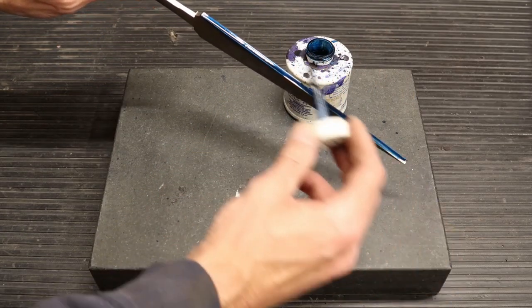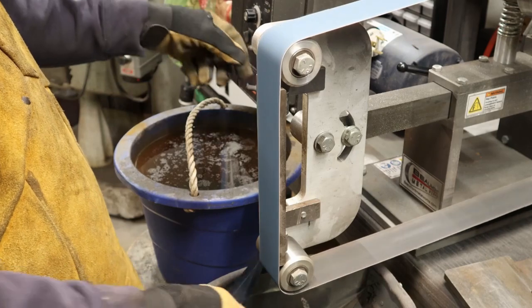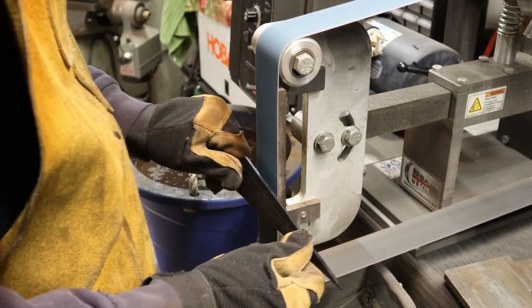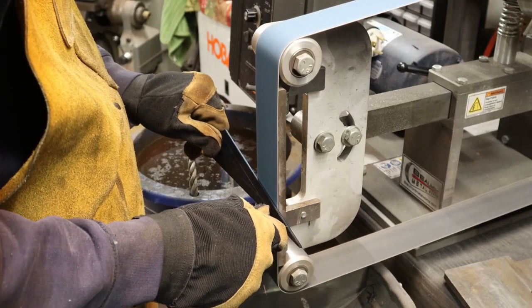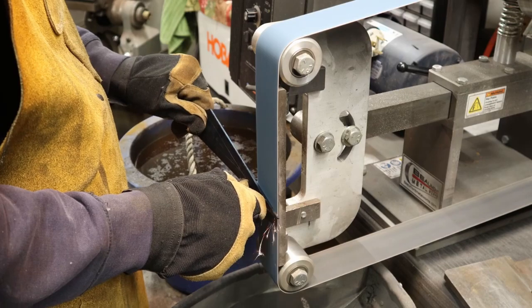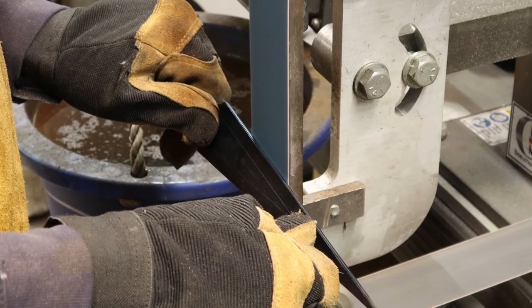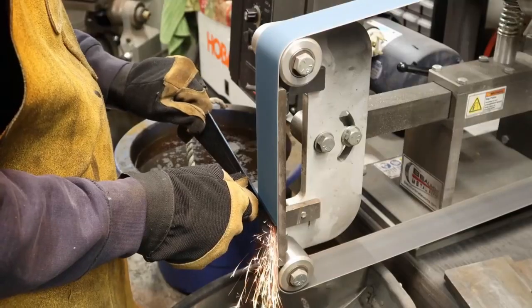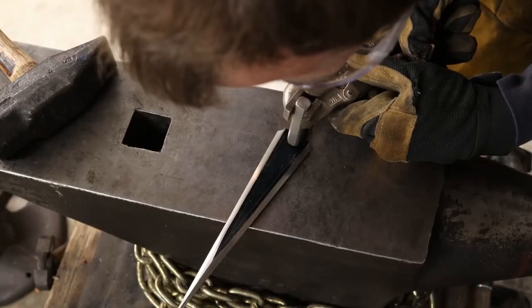Purely aesthetics. Scribing the center line for the cutting edge — and I also want you to take notice when I bring this knife blade up, you'll see that I marked some lines on the flats. Those are grind-to lines for my bevels. Before heat treat you'll notice I didn't grind all the way to those lines — those are reference lines. That's where my objective for grinding will be after heat treatment. I scribed those lines now to give me a good visual aid as to how high I should grind my bevels before heat treatment.